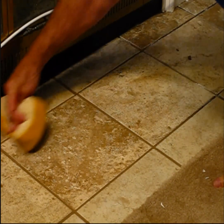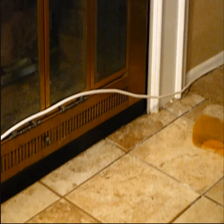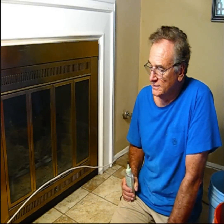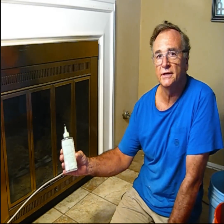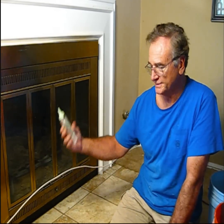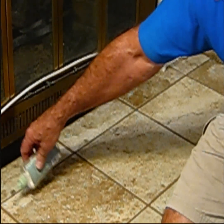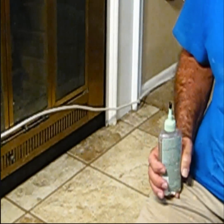That's pretty much it. Once you've done all that and cleaned it up, let it cure for probably 48 hours or thereabouts, then get a grout sealer — but don't apply the sealer until the grout has fully cured. A sealer is simply a chemical that keeps stains from penetrating into the grout. I like this little applicator with a brush on it — it's very easy to use. Just go along every bit of the grout, follow the directions on the bottle, and you're all set. And that's it — we're done.